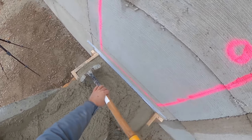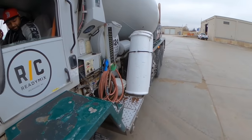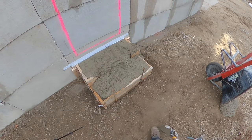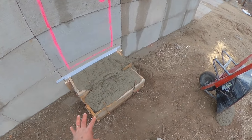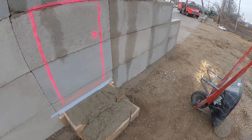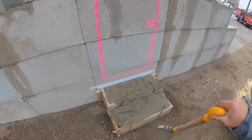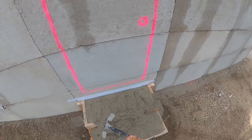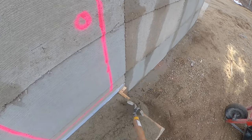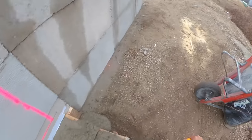It's a little wet but we'll work with it - it had some fibers in it too, which is fine. I just got the concrete in, slopped it in there, and wanted to make sure we had enough. I was trying to get the truck out as quickly as possible since they did that for free and needed to reload for the next paying customer. Obviously I have a little too much, so the first thing is to get it somewhat in order, scraped down to the top of the forms. You really want to work the concrete in to help eliminate any voids against the forms.